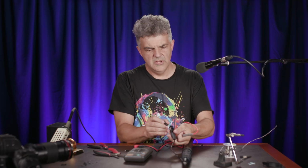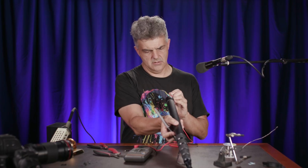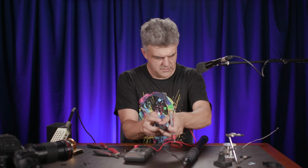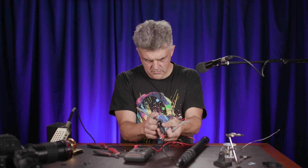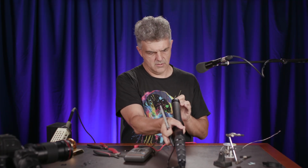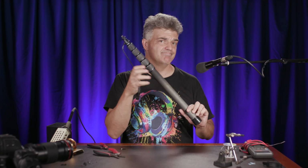Okay, and before I plug it into anything, I'm going to check to make sure I have all the proper connections with my digital multimeter. Make sure that pin 1 is only connected to pin 1 on the other side. There we go. Good. Make sure pin 2 is only connected to pin 2 on the opposite side. There it is. And make sure pin 3 is only connected to pin 3 on the other end of the boom pole. Very good. And that, my friends, is how to replace the cable that's inside your boom pole. Thanks for watching.